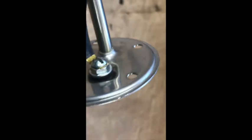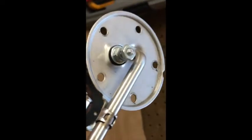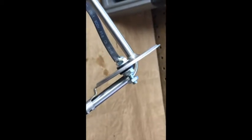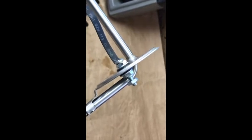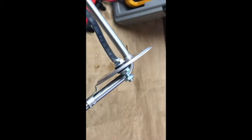You can see it wedged in there. So there's a plumbing washer on that side, and a plumbing washer on that side, and they are bound in there by the two nuts. And then the terminal will go where the space is between the two nuts — you see where the lock washer is there? The terminal will go on the rest of the stud right there. So I have no more time today — I have to leave right now. But that's what we're going to try.